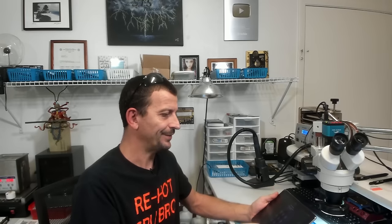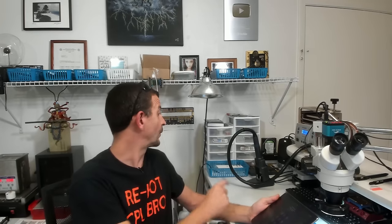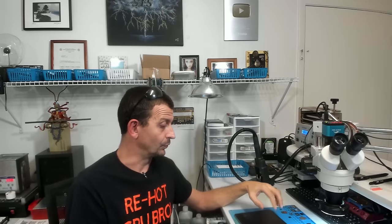All right, so here we are. I took a break from this and I spent some time and I worked on another device. And I'm coming back to this to check and see, and we are at 21% battery power, which is excellent. And that is really good news for this iPad because it would not charge at all. Once it booted, it was drawing zero charging current and it would shut off and then turn itself back on, come up and boot and shut off. And that's what it did. So, gosh, heck yeah, that makes me happy.